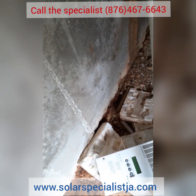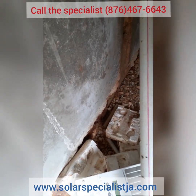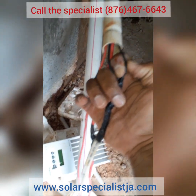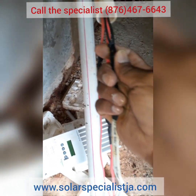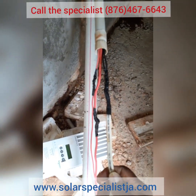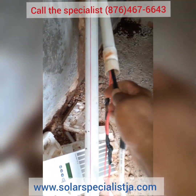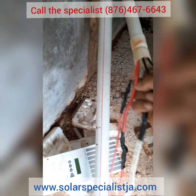You can see these couplings — there's no PVC cement. Now, here is what is of concern to me. See the wire? These are the two negatives that came down. They used 2.5mm wire, which is designed for AC wiring — that's what you'd use to wire your home — but this is definitely not recommended for a DC powered system. These are the two main cables coming from the roof: your negatives and your positives.